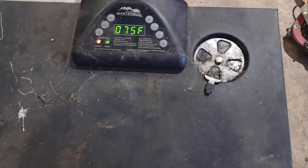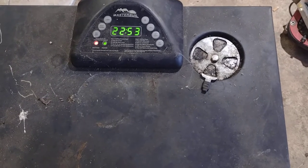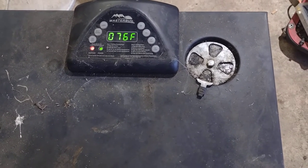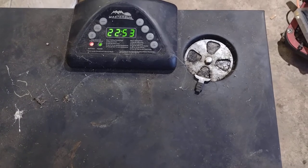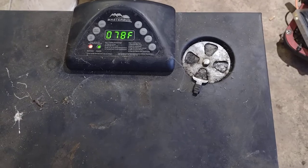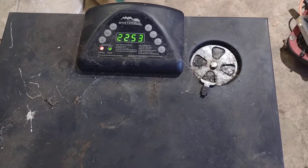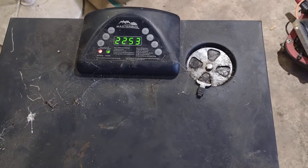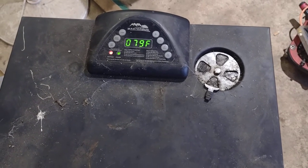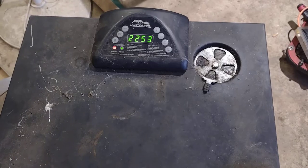I've had it running now for seven minutes and it's gone from about 50 degrees up to 77, and it's steadily climbing — so I guess it's fixed. It's definitely not 70 degrees outside, it's kind of chilly, so that was a pretty simple fix. All it took was a Phillips head screwdriver to take the back plate off, a wire brush to clean it, and wire crimpers with a little terminal. A really simple fix to bring this thing back into operation after it sat for a long time.